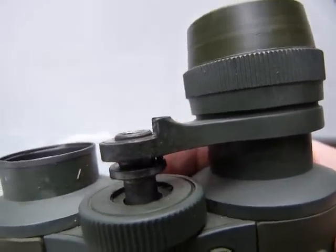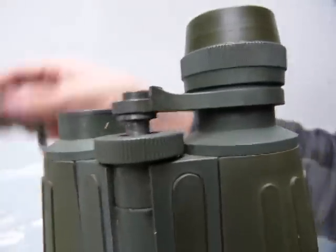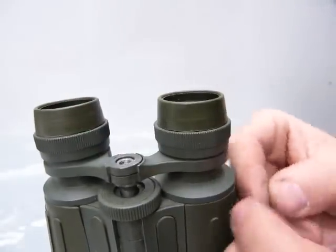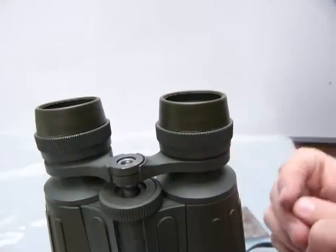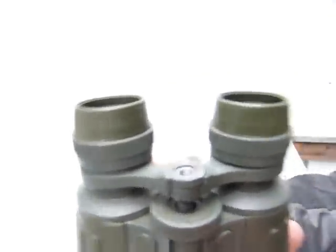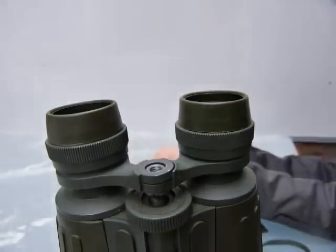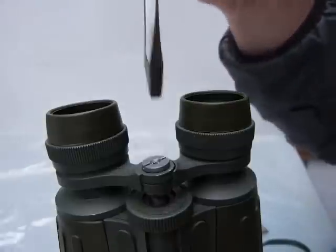There's the groove — rotate it and there we go. The other side goes back on. This bolt eventually needs thread lock, or I might replace it with a longer one because it's so short and looks ridiculous. I have 10 millimeters of thread in there from cleaning it with a tap, so I don't understand why they used a four millimeter long little mickey mouse bolt.